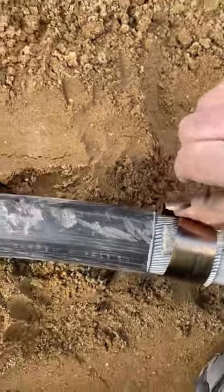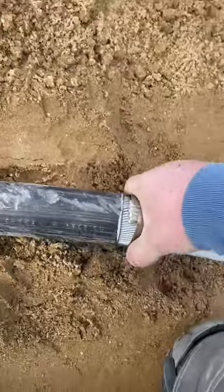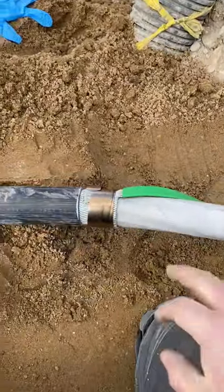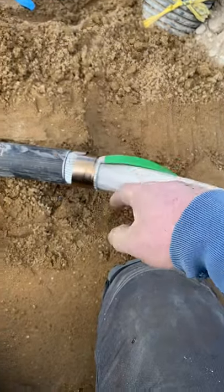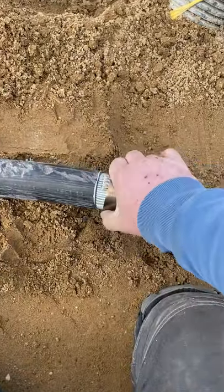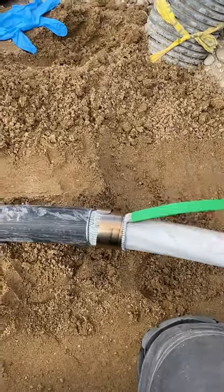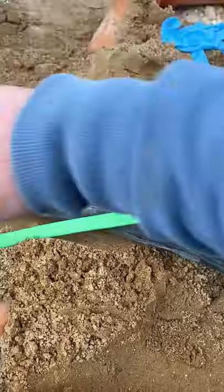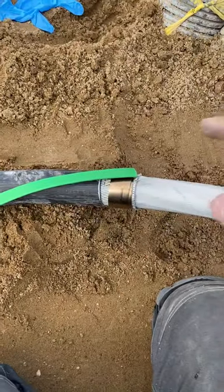Now this is the braid — you've got to watch out for that bit because my old fella years ago sliced his finger nearly — that bit of webbing in between your thumb and your finger — he sliced that, oh how he bled. So now this just gets bent back out of the way and we'll come back to that once both cables are prepped and in the joint.